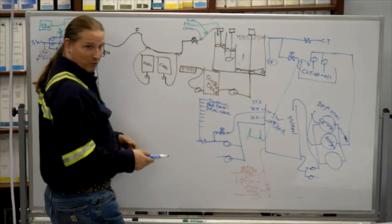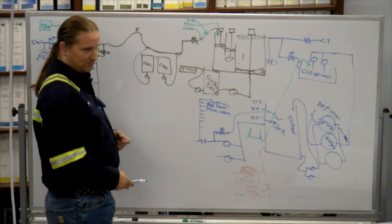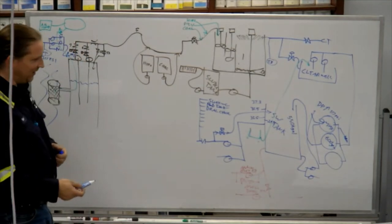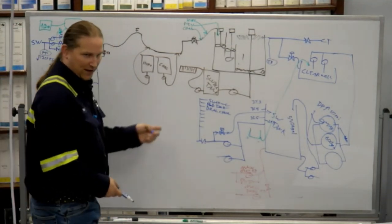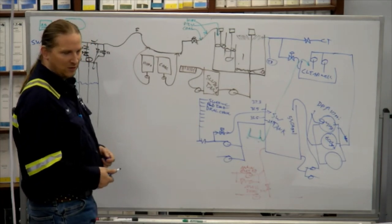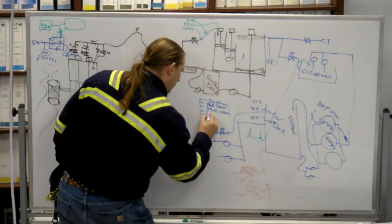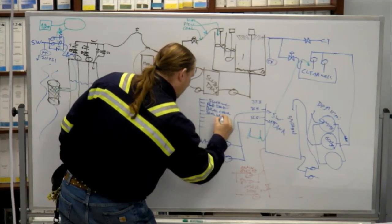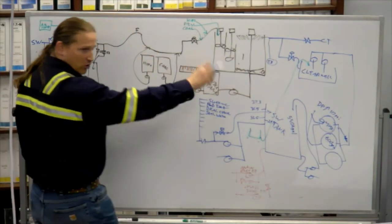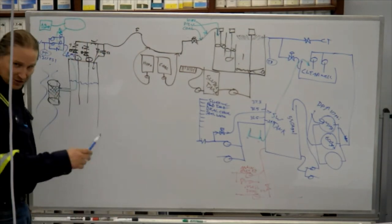That FGD tank is the lion's share of the water we're using. Using 50 gallons a minute through six atomizers, so that's 300 plus gallons a minute. The slaking water is in the 150 to 200 gallons a minute ballpark, and it kicks on and off depending on tank level and how much slurry we're using. There's one more big user. Okay, we have seal water. Out of the river water, we got seal water at the surface water pumps, we got seal water at sump 3, there's probably some other little slurry sumps.